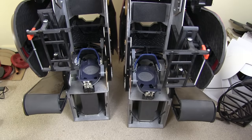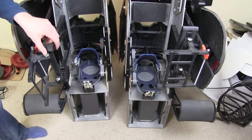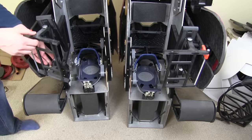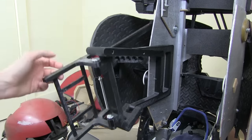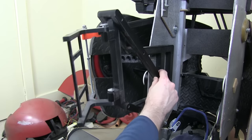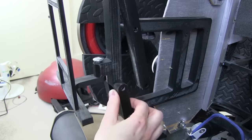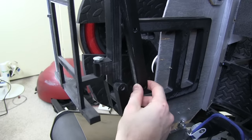These are fitted right back on which is excellent. Just to demonstrate the mechanism — this is where the back door is mounted, and as I open it, it opens like this and also drops backwards. The plan is to build the back of the legs onto here and it should hinge back into this cavity. I do have one small issue which is that they can turn inside out — where this gets jammed and goes the wrong way. It should go that way, so I need to put a little end stop on here just to stop that moving the wrong way so it always goes outwards.